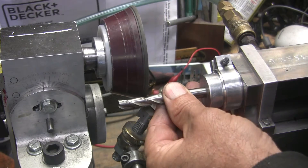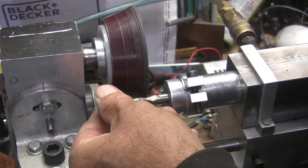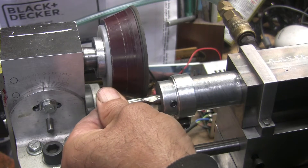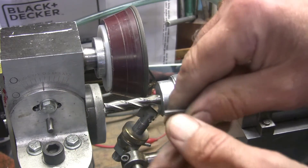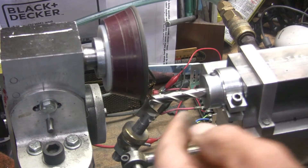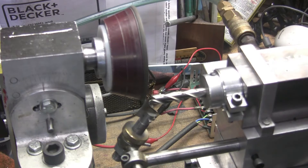Get it on the finger. It's all set up for 3/8" right now. It could do 3/8", 2-flute, 3-flute, or 4-flute — it wouldn't matter. I'm just getting the finger, getting the distance set out. Tighten that up. Make sure I come off of the finger. The finger holds the end mill with the flute you're sharpening parallel to everything.